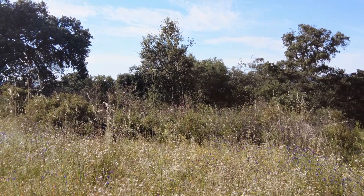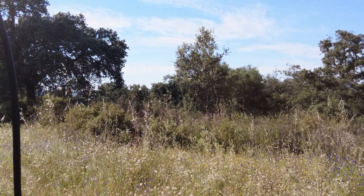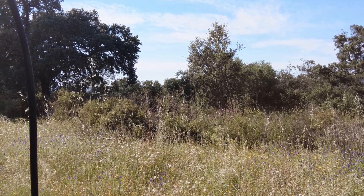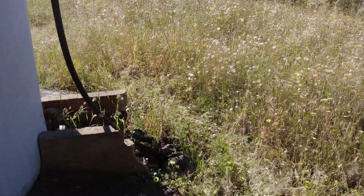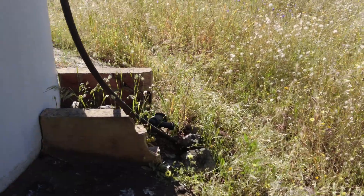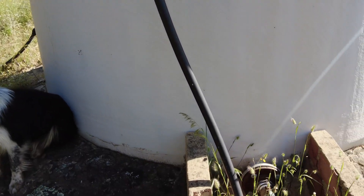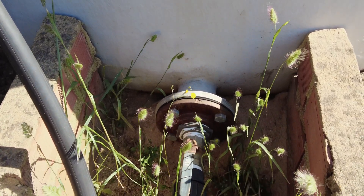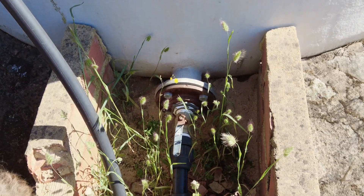Let's talk about irrigation. We are busy installing an irrigation system and it's quite tricky, but we start somewhere and then we see what we have and build on it. Here we have a 10,000-litre water tank at the highest part of the land, with a flange and a 40-millimeter pipe leaving it — this is our starting point.